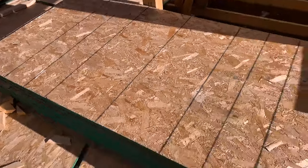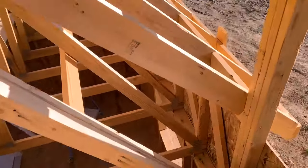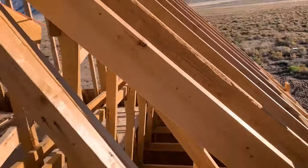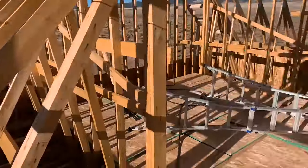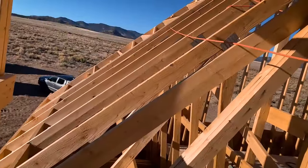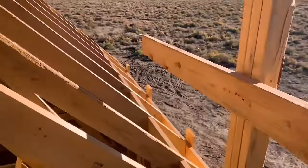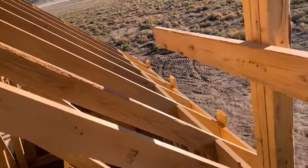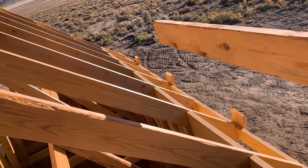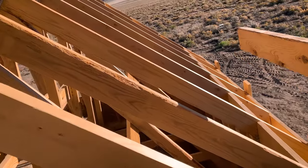A quick word on how I'm going to do the roof sheathing myself — these are 5/8 sheets, so they're pretty heavy. I've put these blocks out on the fascia board so that when I slide a panel out here — because I'm in the dormer right now, that's where I put both sets of sheathing for the roof — I can feed them out through this gap here. If I didn't build out this sidewall to give myself that space, it wouldn't work. I'll slide them out and these boards here should catch them, at least the first row, and then I can just start using each row below it to catch the next one.